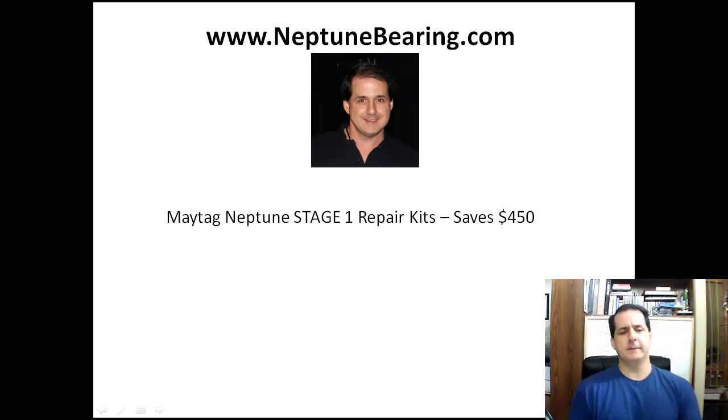Let's start with the Maytag Neptune Stage 1 repair kit. I developed this one back in 2008, and it was for the Maytag Neptune washer, and they had a systemic failure where the wax motor and the door latch would fail and damage the control board, okay?